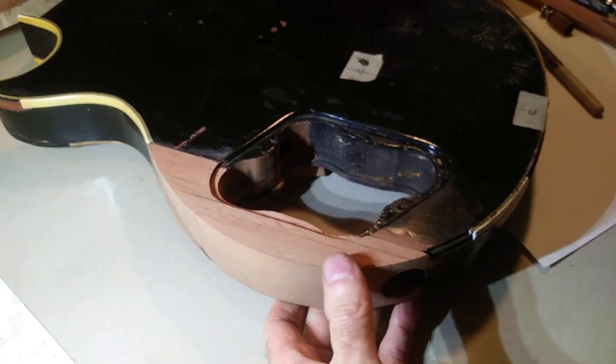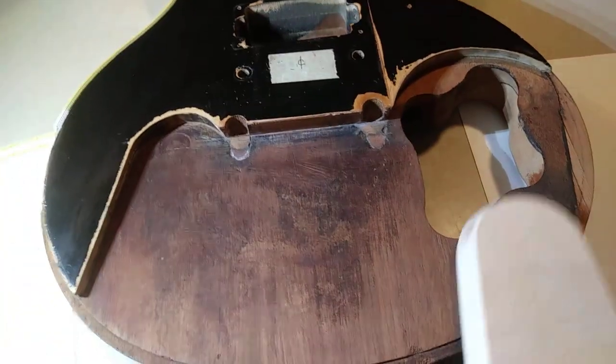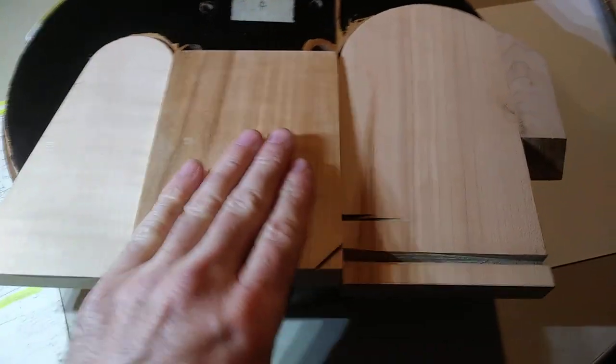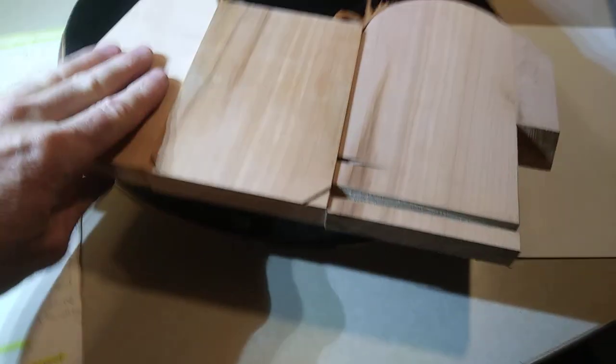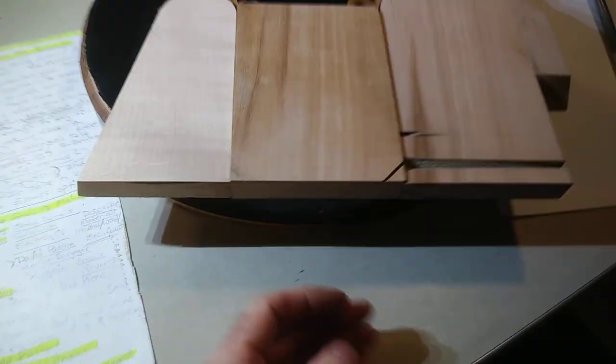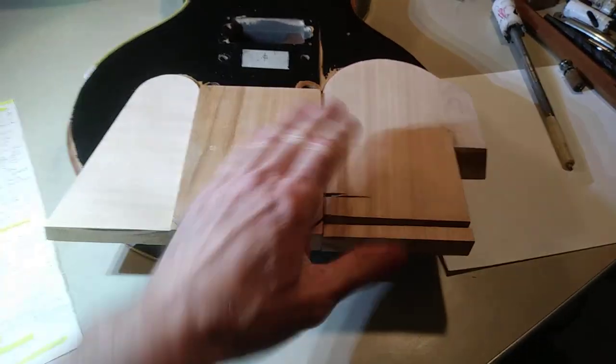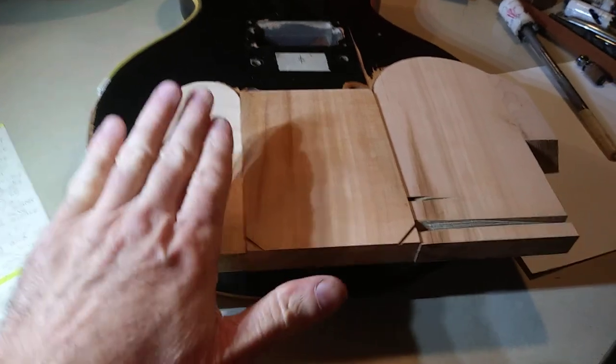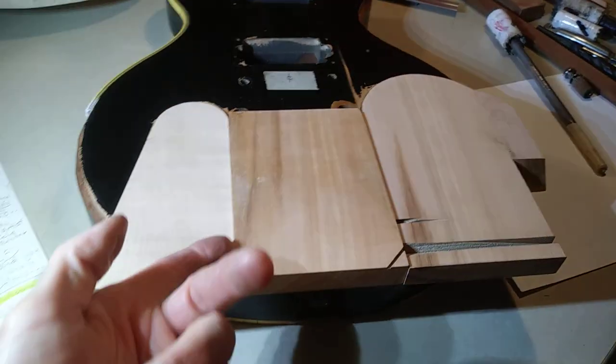Maple fitment and tap tone analysis — I'll talk about the maple fitment just very briefly. Hear that? As you're beginning to handle this it's like a turkey call — it's coming alive. I got everything lined up and verified. What you can do is, once you've got this piece in place, lay a straight edge down there and see if there's a gap.